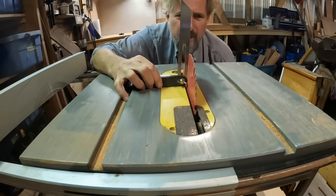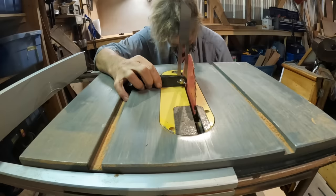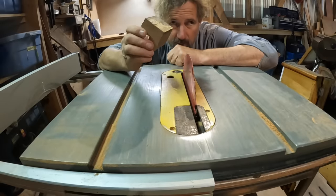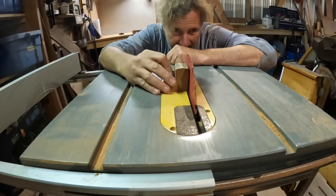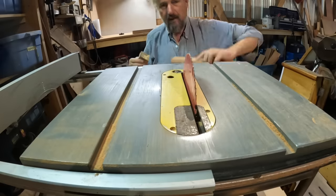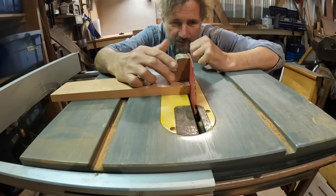Pull this back just a bit. I find it easier if I set the bottom to touch first and then close the gap at the top. Why don't we try actually just checking the block against it — and this will expose one of the problems with doing it this way. If I set it against the insert, it doesn't actually fit perfectly because the insert is not perfectly flush with the table. So I'll just add this piece of wood here which will project over and we'll set that against the blade — and it is absolutely sweet.